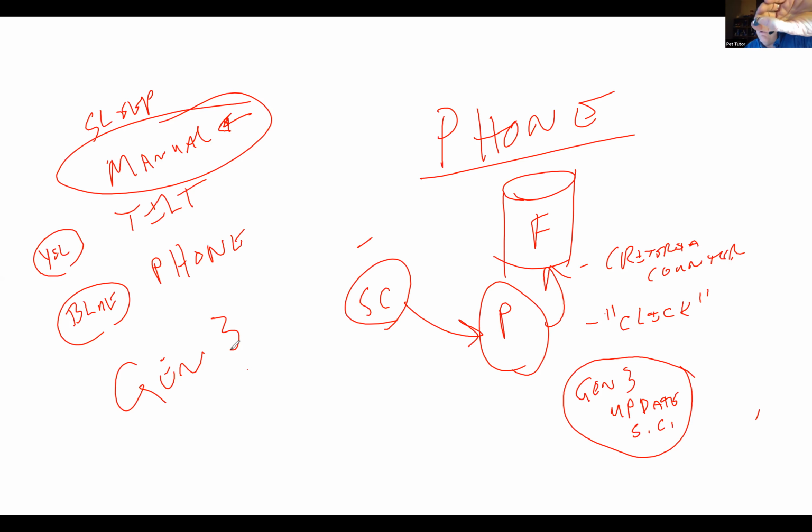Now you'll see the coin battery. It has a plus symbol on it. I don't know if you can see that with the flash, but there's a plus symbol on the coin battery. And you put that so that it is facing away from the board. And there's also a plus on the metal battery holder. You'll see that. And you slip that back in there.